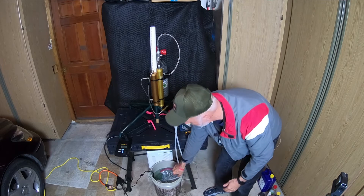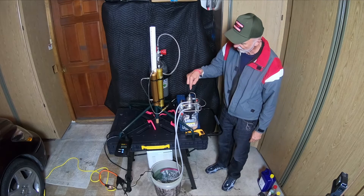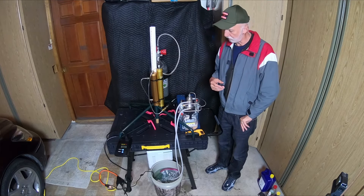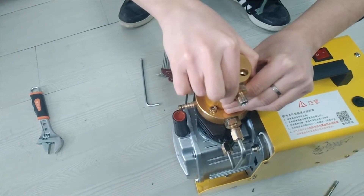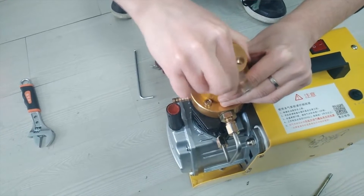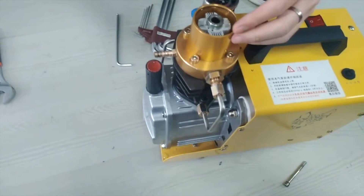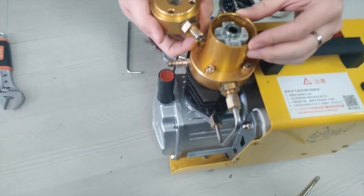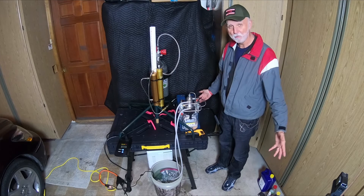The water coming out is lukewarm now, as you'd expect, because it's going through the second stage of the piston. In addition to being about the size of a pencil in this area up here, on the outside it has a radiator assembly — fins coming out on both sides — and that's where the water is circulating. A tube carries water around the piston so the air going through is being cooled. That little baby is working hard to get us a lot of pressure for a very reasonable price.